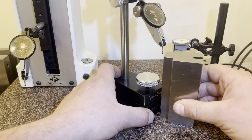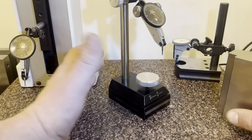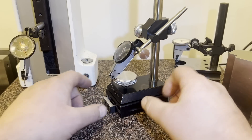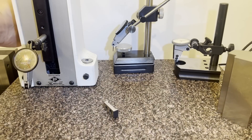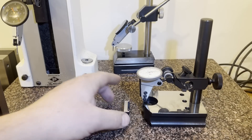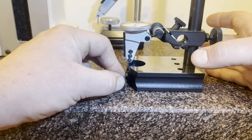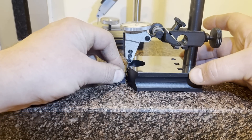Here is a typical square-checking setup: a standard height gauge with the indicator flipped around to the backside, which allows you to compare each side for squareness. Most square or height gauges offer something like this, but they all lack capacity to check smaller parts — the indicator won't go much below an inch and a half. You can also use a sliding gauge like this PMC Lone Star, but it's a little clumsy for something so small. I have this comparator gauge which is ideal for short parts, but even it is at its limit at half an inch or 12 millimeters.